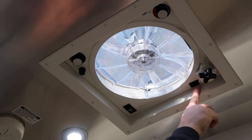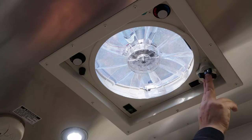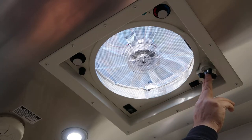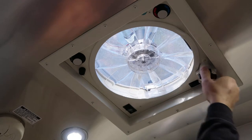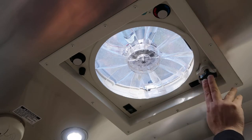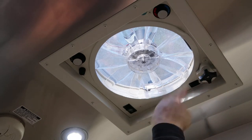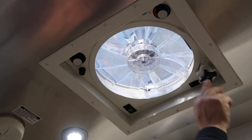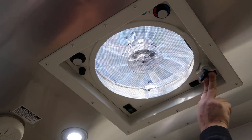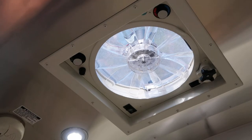On this side there's a switch for opening and closing the outside door, or changing the drive from electric where it does it automatically. If you pull straight down, you can turn it and do it manually. If you hear the motor running and nothing seems to be happening, double check this — make sure it's pushed up, clicked, and engaged so that everything works.